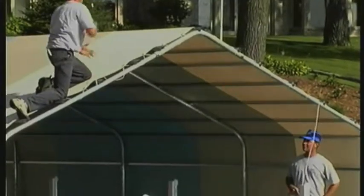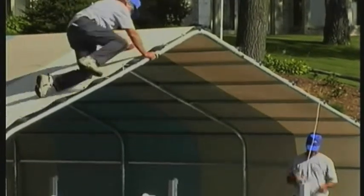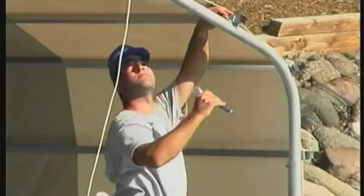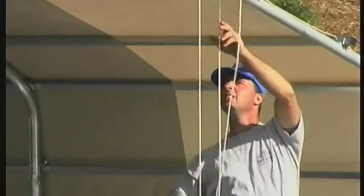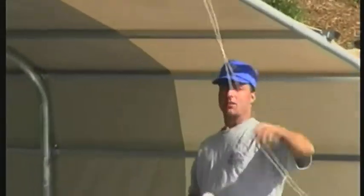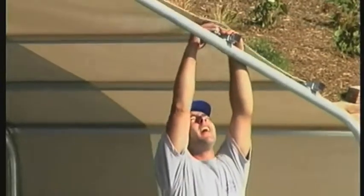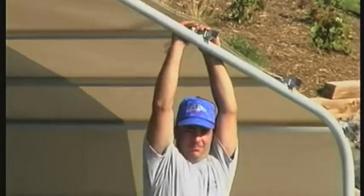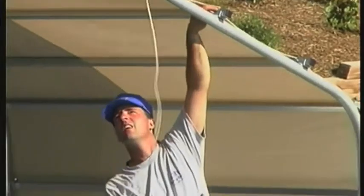Start removing the canopy rope at the end of the open walkway, climbing up the bow as you remove. On the side of the covered walkway, remove the rope as far as you can reach. The rest can be removed from above. Remove the side ropes. Loosen the slat set screws, pop the slats out of the bracket, and put the slats above the slat bracket.